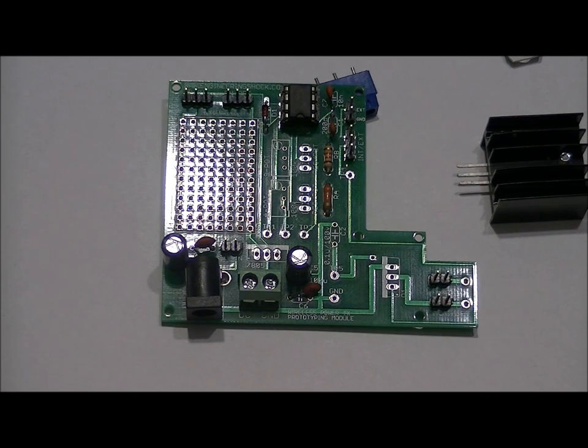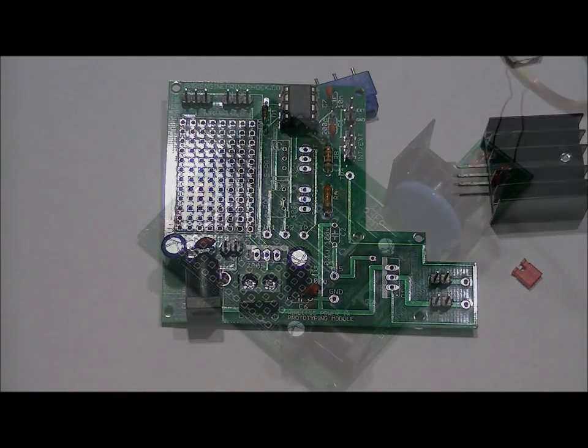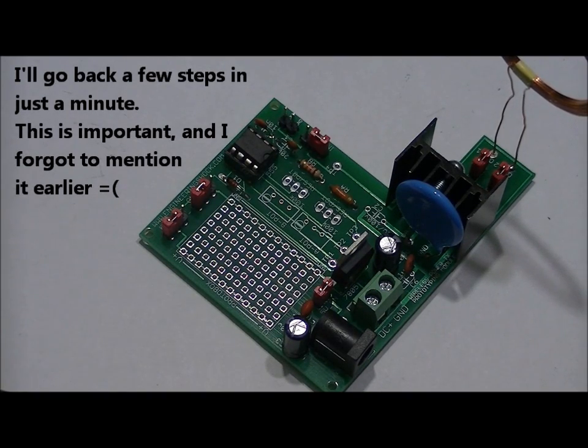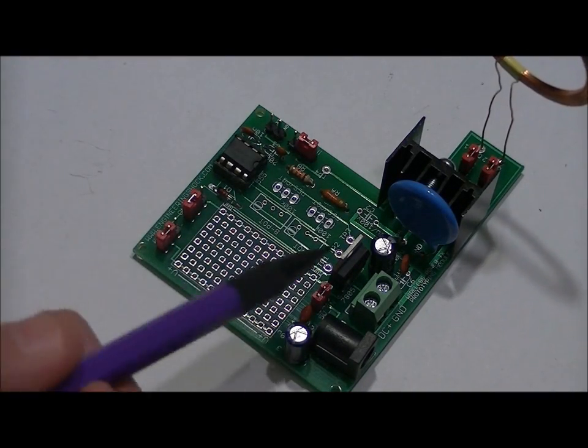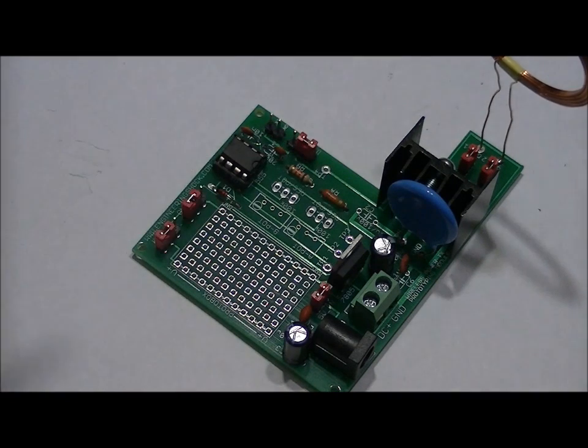There are a few different ways to test. The best way is with an oscilloscope, but you don't need one. You do need to have the receiver assembled, which we'll get to next. If you don't have an oscilloscope, you need a receiver to ensure that everything is working. However, we can check that everything else is working by just using a multimeter. Also, I neglected to mention — solder two extra three-pin headers to two additional slots in this area of the board.